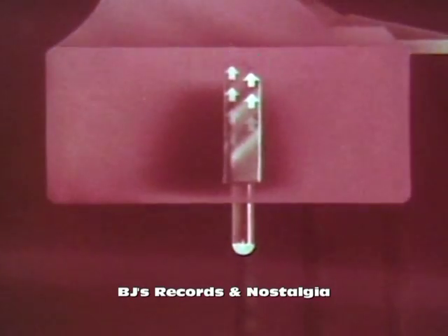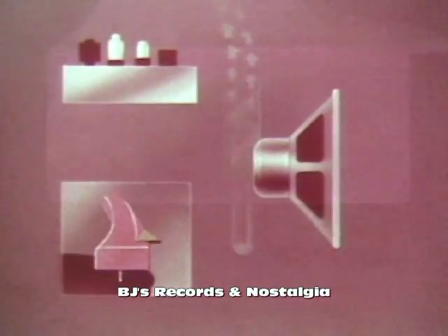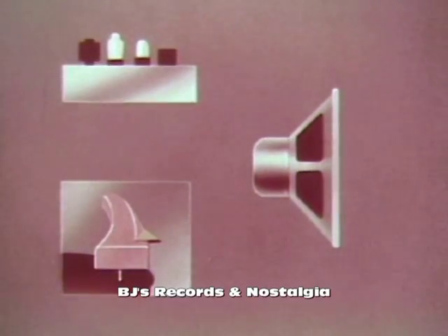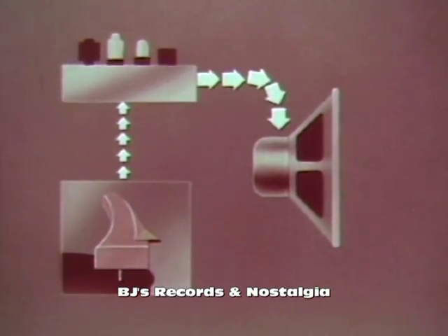To play it back, we substitute a stylus for the cutting head. The tip of the stylus works back and forth, side to side in the groove, bending the ceramic bar to which the stylus is attached. When a ceramic bar is bent, tiny impulses of electric current are produced. These impulses of current, again strengthened by an amplifier, are carried to the speaker, where they are converted back into sound — the same sound we had at first.